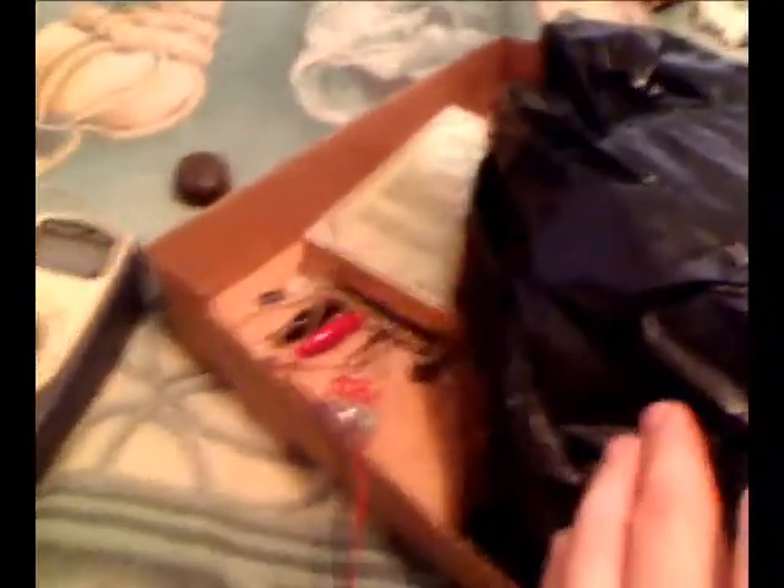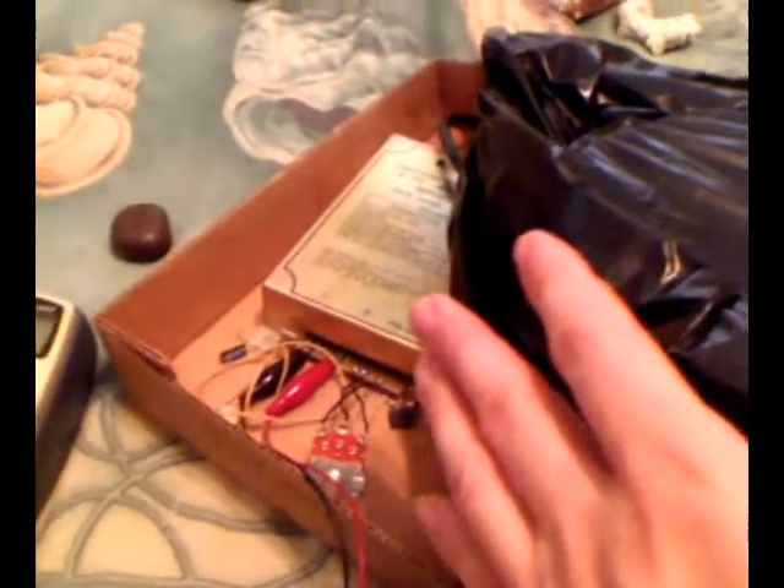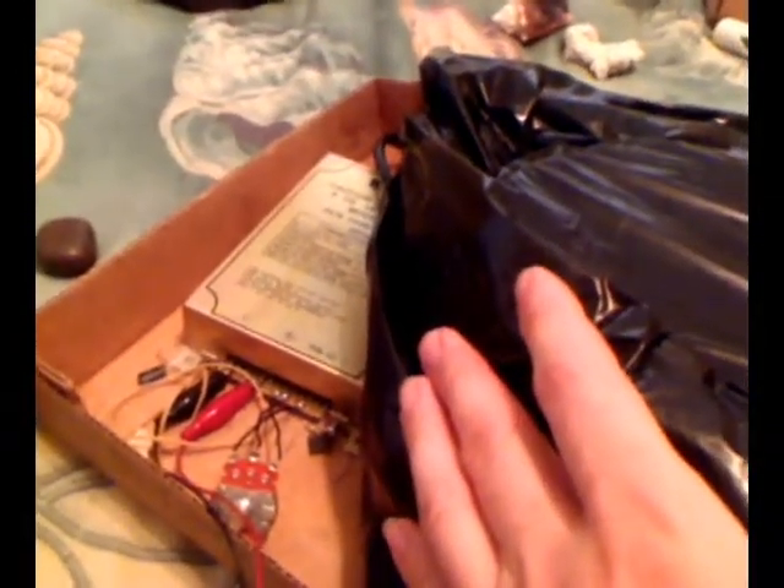I've got to work quick. Over to the side here is the Bertan brand negative one kilovolt power supply. I have it cranked down to about 750, maybe 800 — I think at last check it was 797. Keeping it low, even though these tubes can withstand very high voltages, like 1300 volts maximum working voltage.